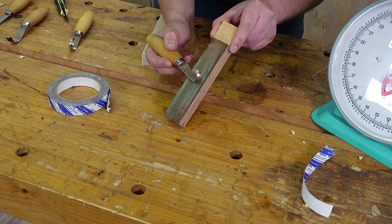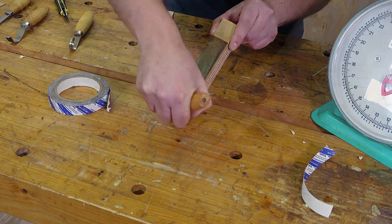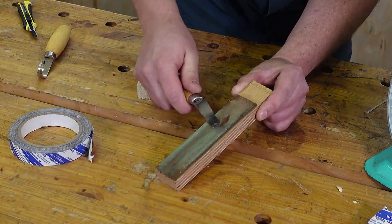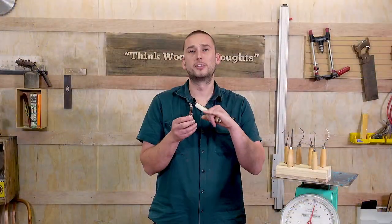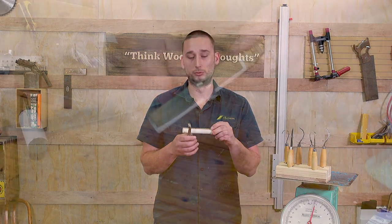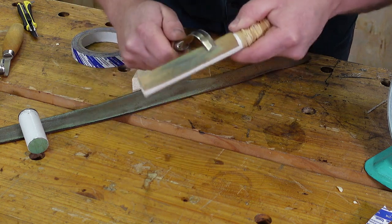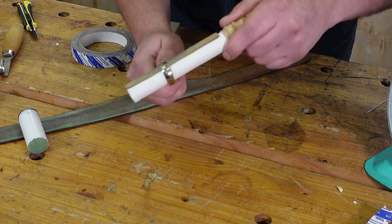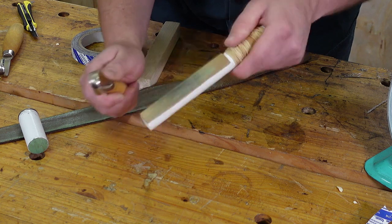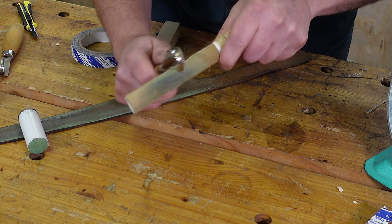This time we're going to have to roll the blade to make sure we have good contact along the entire bevel, but just take your time and maybe give it a few practice runs and you should be fine. Now for the inside faces we're going to use the round strop that we made, and this time we're going to rotate the strop to change its contact area instead of the tool. Remember though, we're polishing the back side of the knife here and not a bevel, so try and keep the blade as flat as possible and only tilt it enough so that the back edge doesn't catch in the leather.